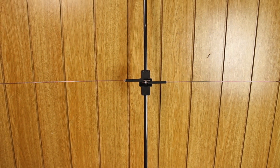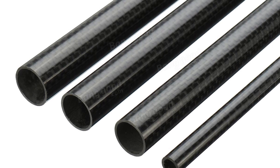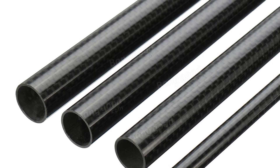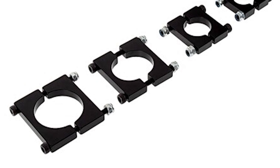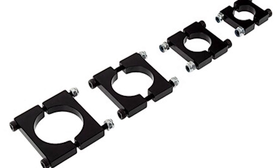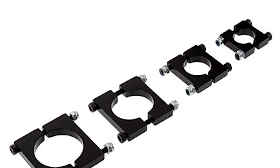If you want to build such an antenna, you need the following materials: two 12mm carbon tubes, about 50cm long for the 2-meter band — adjust the length for other frequencies. Then you need four clamps for these carbon tubes, also 12mm, and the clamp screws are 3mm.